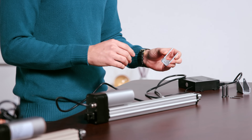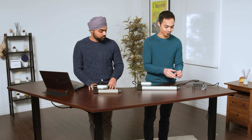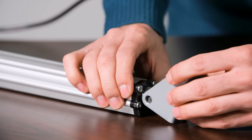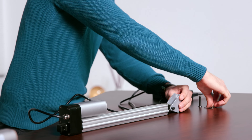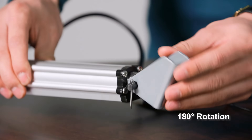The BRK-09 allows for over 180 degrees of rotation. Installing each bracket on either side is simple: just line up the bracket at the end of the stroke, line up the holes, slide the mounting pin through, then grab the cotter pin and put it right through the mounting pin.